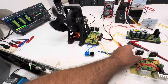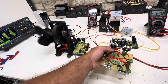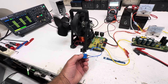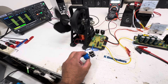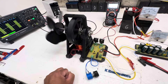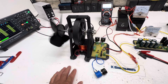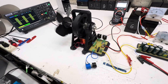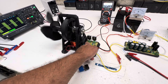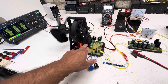It actually runs really strong, but you have to set the resistors and go from there. I designed this one so you could tune the pot just like a regular Bedini circuit. This one has PNP and NPN, so whenever it switches, it switches both polarities. You have your negative side of the coil and the positive side of the coil, so every time these turn off the coil is completely isolated.